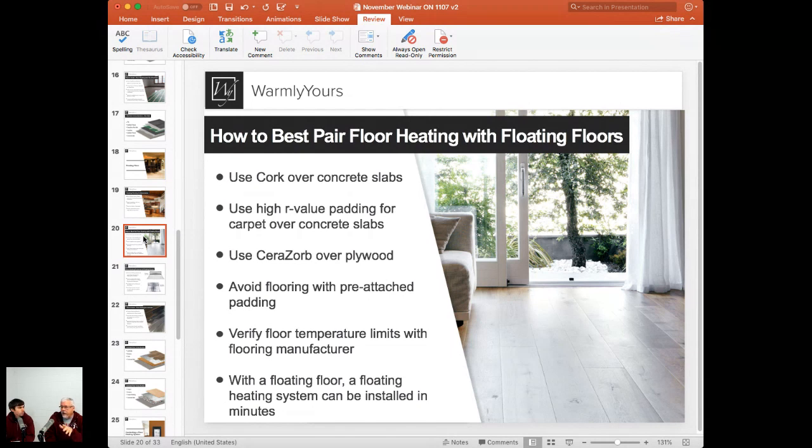I'm going to stop you right there, because historically, hot radiant heat was done in the old days with hot water. So if you had a hot water system in the slab, you want to make sure that your carpet pad is low R value to let the heat through, and you want to make sure your carpeting is low R value to let that heat through.